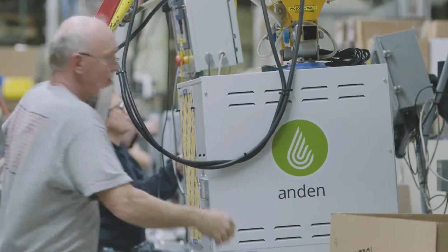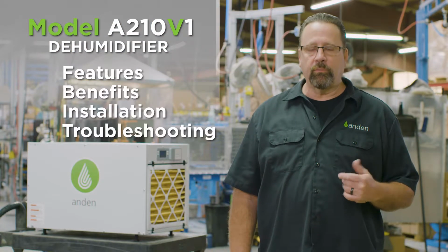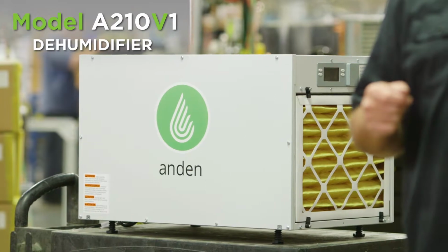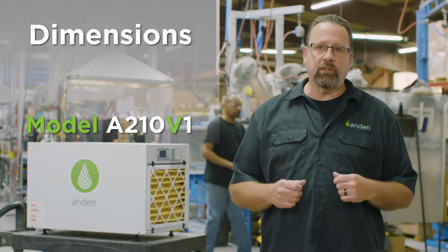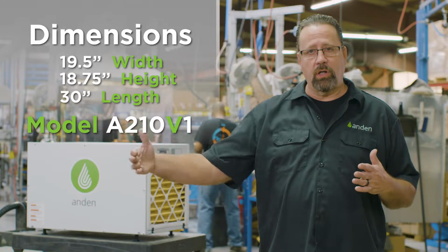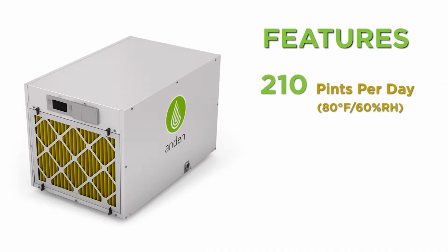I'm going to go through an overview of our model A210V1 Dehumidifier, its features, its benefits, installation, some troubleshooting, everything you should need to know about that product. Our A210V1, we actually were able to reduce the size down to our 130 pint cabinet. So the cabinet's basically 19.5 inches wide by 18.75 inches high and 30 inches long. So pretty compact unit. That unit is 210 pints a day at 80 degrees and 60% humidity.